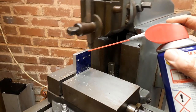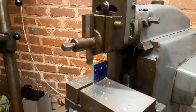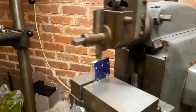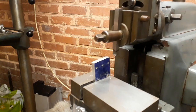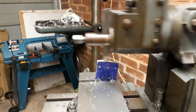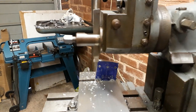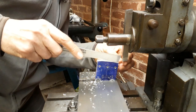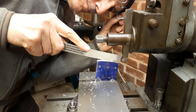Facing up the ends of the motor mounting plate. This could have been done by hand — I could have hacksawed it and filed it — but it was nice to use the shaping machine. The two beveled edges represent the extents of the degree to which the plate can rotate. I'm just checking here that they're the same length and finally producing the second taper to match the first.